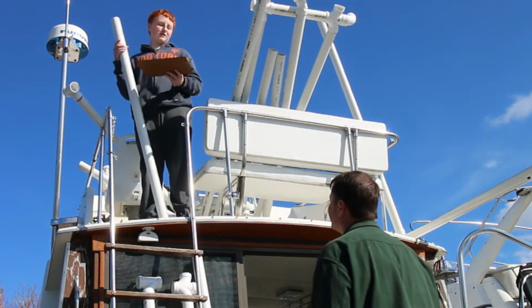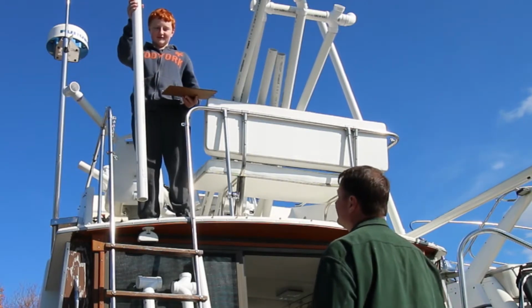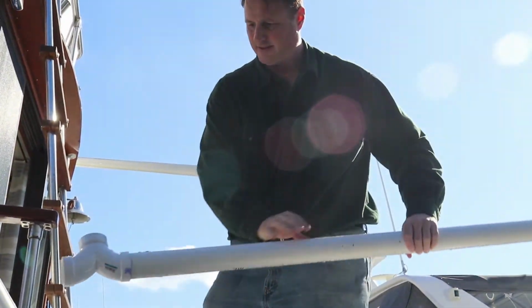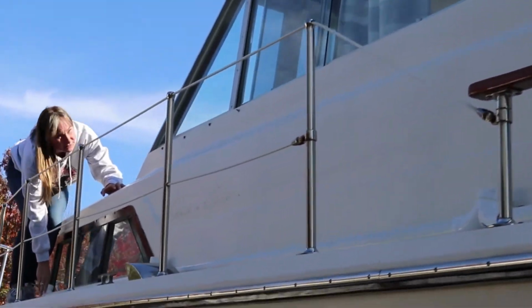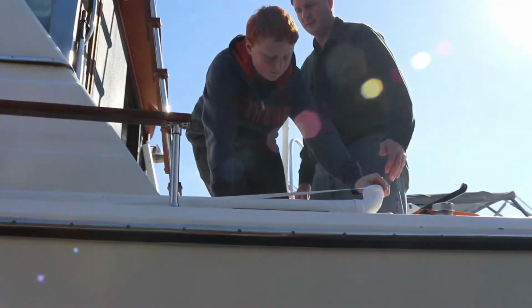Speaking of which, we're still following our handy-dandy blueprint I made. Sam's making sure that we're sticking to all of our tasks as we begin placing and fitting all these puzzle pieces together. Nikki moves to the front of the boat as we take the 16-foot assembled pieces from the frame and slide it down. We then take some strapping and wrap the strapping around the ends and tighten it up, so that it all stays together.